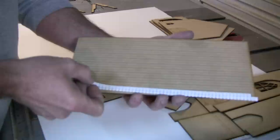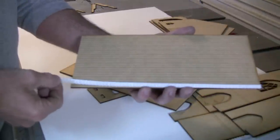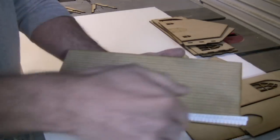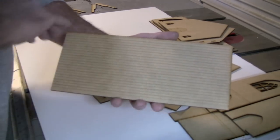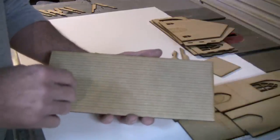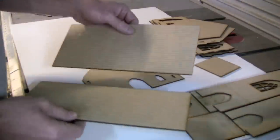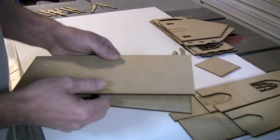And you offset each one, you don't line them up with the lines this way, you offset each one by half as much. Now they hang off the edge on both sides. You'll put them all on and then trim them off flush. And just follow those lines all the way up, and that way you won't have wavy shingles. You can make them purposely a little bit wavy if you want, which makes them look a little more random and a little more rustic. But these are a good guide for you as to where they go and the spacing.